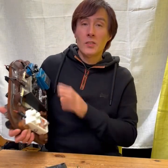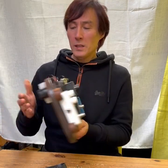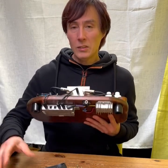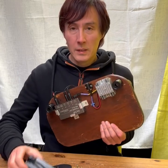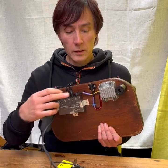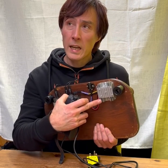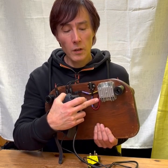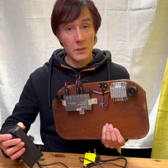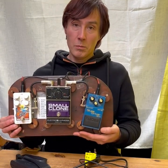This is the completed pedal board with silent power supply on the back. Interestingly, you can use any computer power supply you find that's quiet, as long as you've got the right connector, because this regulator will regulate anything from about 9 to 40 volts into 12 volts to supply your isolated power supply unit. And there we have it — it's done!